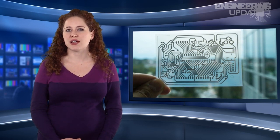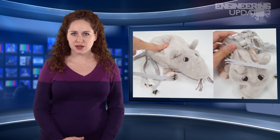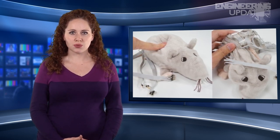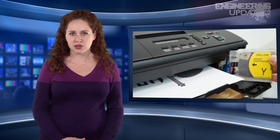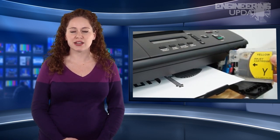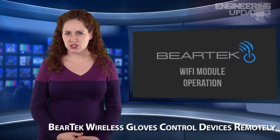This could be important news for electrical engineers who may now find the possibility of chemical sintering more accessible. Such printed circuits can be attached to components using conductive double-sided tape or silver epoxy adhesive. Georgia Tech was able to measure the liquid contents of glass by attaching a capacitive ribbon with the circuits to the glass and connecting the contoured circuitry to a microcontroller.